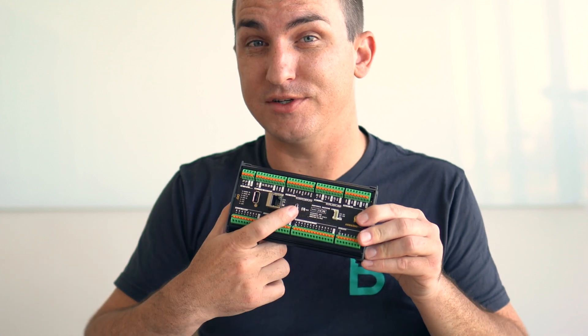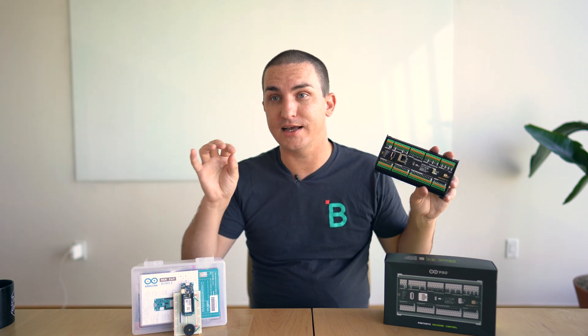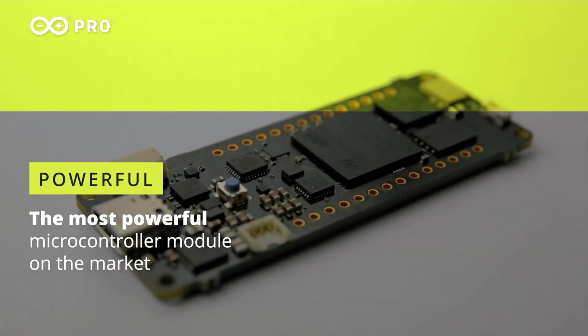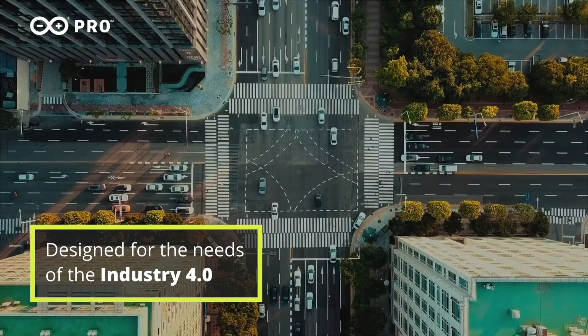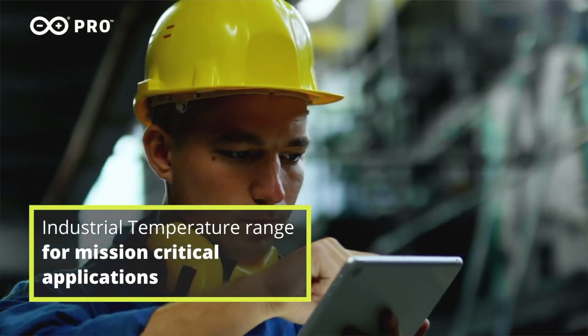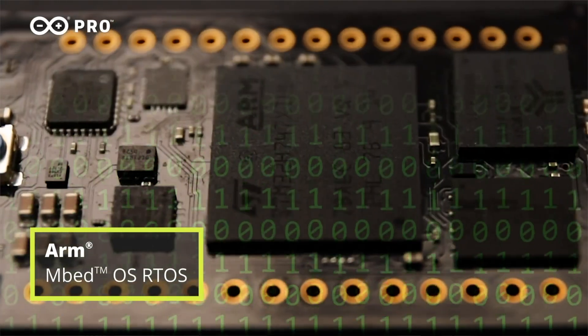The other thing is that this is a USB micro — I wish that was a USB-C. This is like the industrial PLC brother — the PMC brother — of the Arduino Portenta H7, which came out about a year ago. That one is groundbreaking in the sense that it has two processors, and when you're loading your Arduino programs onto it, it gives you the opportunity to load to either processing core — it really reminds me of the PLCnext with its two processors. These Portenta devices really start to blur the lines between your home IoT projects and your IIoT projects out in the plant. If you were going to do a control system I would use something like the PLCnext, but if you're an OEM just selling a product to your end customer, you want to keep costs low and you have plenty of flexibility in terms of inputs and outputs.